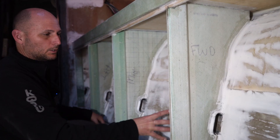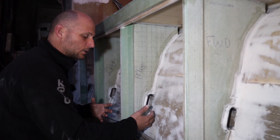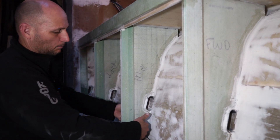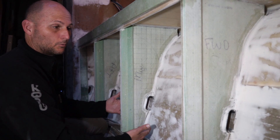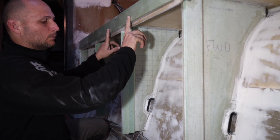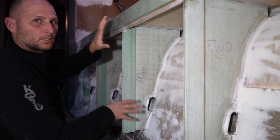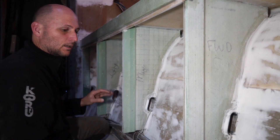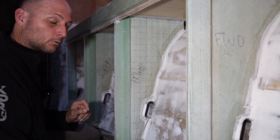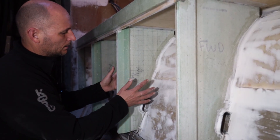You've got to be a little bit careful because these stiffeners - if you try to make them too stiff and too rigid, they will then carry too much load. And the chances of a big wave hitting here, pushing the side out and popping the bottoms off these becomes a real problem. So we've got to be careful that we don't make this too stiff, that it's still got a little bit of flex so that when this pushes in, it rotates and flexes a little bit. You've got to have things talking to things and working together. Everything makes everything stiffer and stronger, but you've got to be careful you don't make something too strong or too stiff.